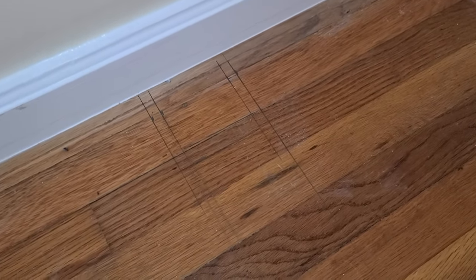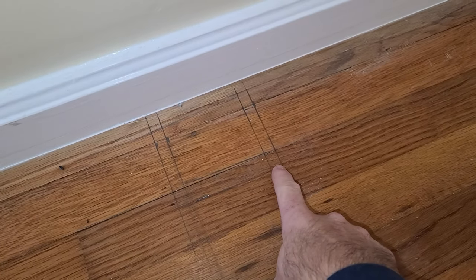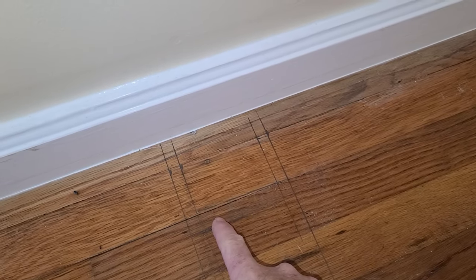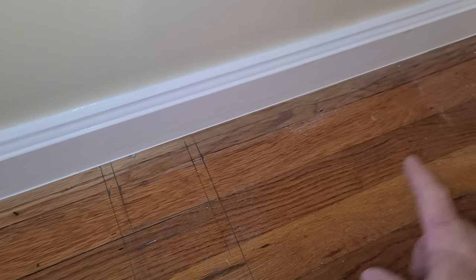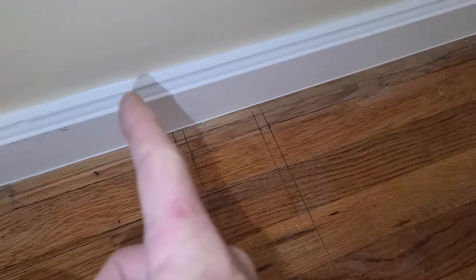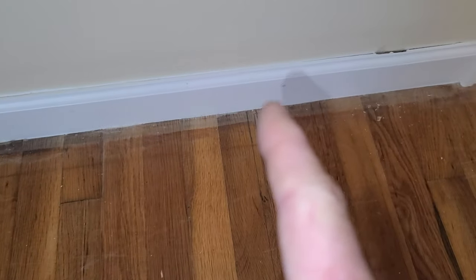So this may be a little hard to see, but what I've marked out here - that's the drywall, that's the drywall. Here's the bottom plate and then this three-quarter inch line represents the casing of the opening plus a little room for shimming. That's about three-quarters of an inch, and that makes it a total of 24 inches from the back of this wall to the face of this drywall, which is a normal depth for a closet. So what I need to do is slice out the base molding here and where I've marked over here as well.